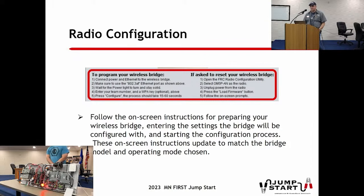We've noticed problems with power levels and various issues. We use a wall power level and have been trying everything. We haven't seen issues with the new REV power module - it's a passive POE and they've been really good; we haven't seen them fail. A couple teams have seen some things, but overall, remember these radios were never designed to be on a moving robot - they're made to sit on a shelf. They had the barrel jack, and before the new power devices came out for FRC, teams would use the barrel jack, then they'd vibrate and break the solder leads internally.